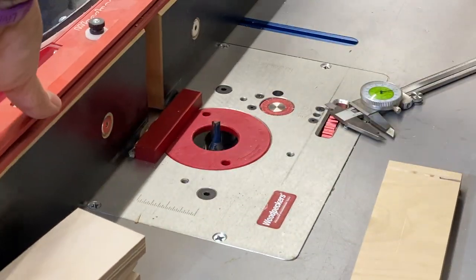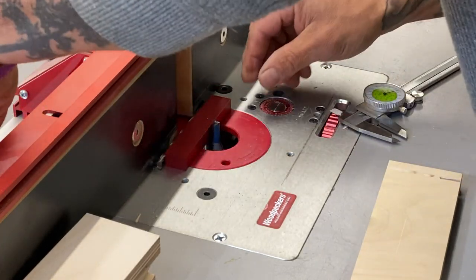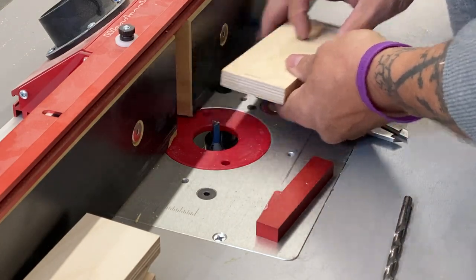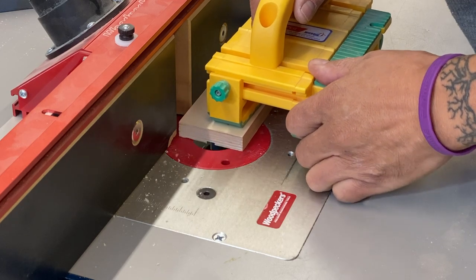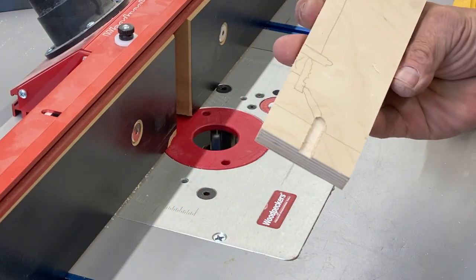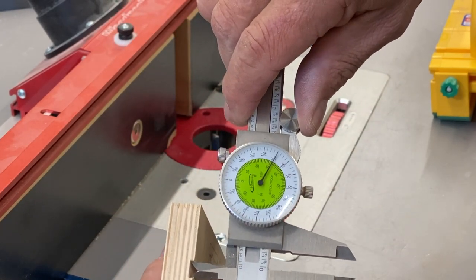This dude is in fact unplugged. We can make a test cut — that should be dead center. And of course here I have a sample piece, I can just make a shallow cut just to check my dimensions. It's probably a good idea to come in from both sides — that ensures that the slot will be centered. This can be a dangerous cut feeding backwards like this, but it's already been cut and I'm just taking off the minimal amount. Then I can check that. Looks like we have a five-sixteenths slot even though the bit has been sharpened and is a little undersized, so that should work well.